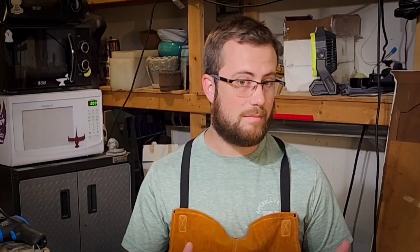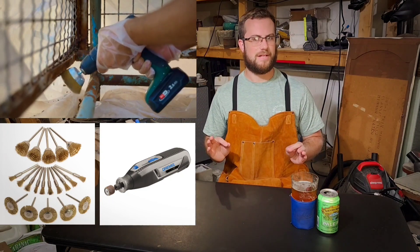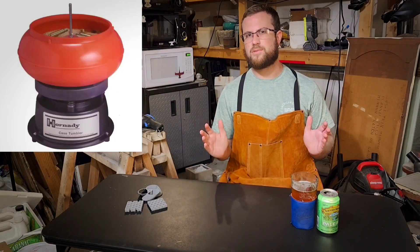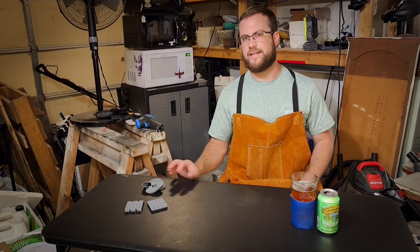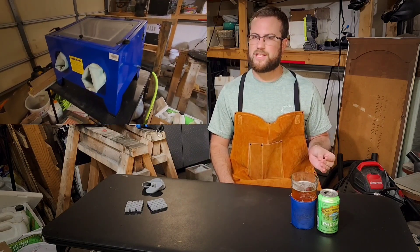For post processing and cleanup, at least you'll need a rotary tool with a wire brush attachment, a filing set, and sandpaper. But I'd like to recommend at least a few better tools as well. A vibratory tumbler works very well when trying to deburr and polish these parts. Additionally, a sandblasting cabinet is even better. You can get these fairly cheap on Amazon, but it does also require an air compressor to work.